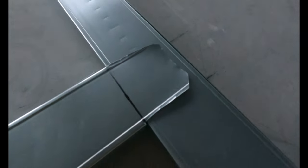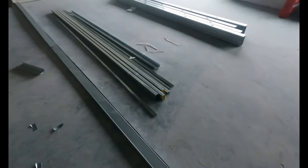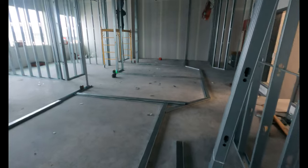We have 12-foot high walls — they don't go up to structure, it's all free-floating, and the drywall stops at 10 feet on this job, so I don't have to cut the top tabs. You've got fishtails — those are the two-inch fishtails, you cut two inches in. You can see how we're overlapping all the corners and doing our fishtails to join tracks together. You've really got to thoroughly think this through.